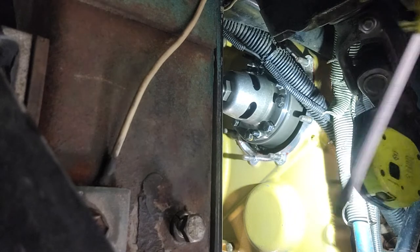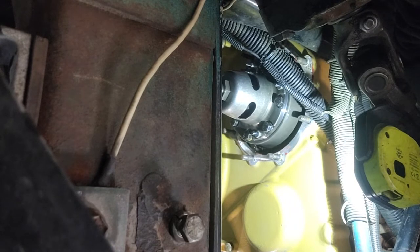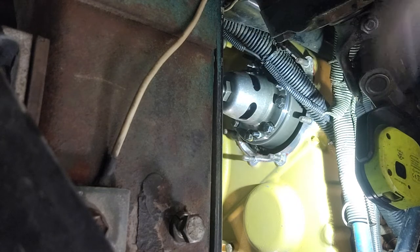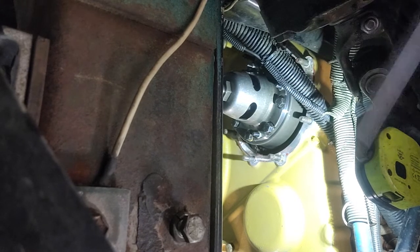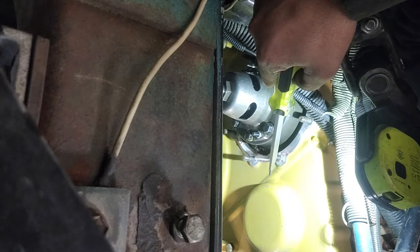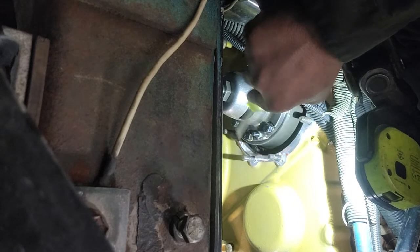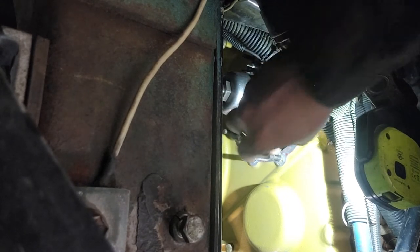Okay guys, one more thing, because I read a comment below on one of my other videos. He asked what happens if oil and diesel are mixing in the motor, and what is the probable cause, because he said the injector is good and the fuel line is good. I suggest you remove your injection pump, because the probable cause is inside here at the front seal of the injection pump. It always happens like that. So if your oil and diesel are mixing in the oil pan, your seal at the front is broken, so remove this one.